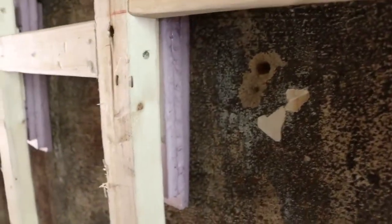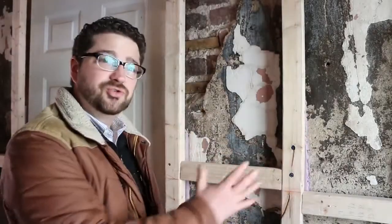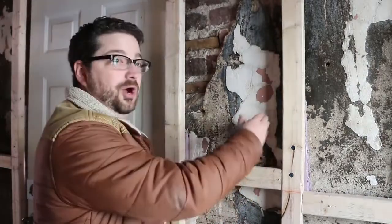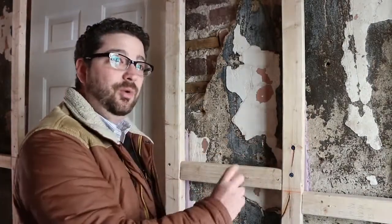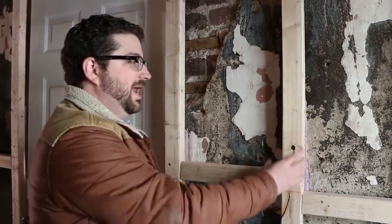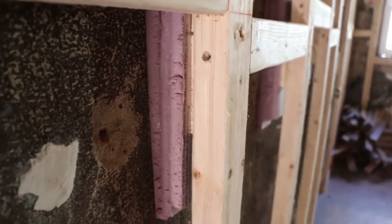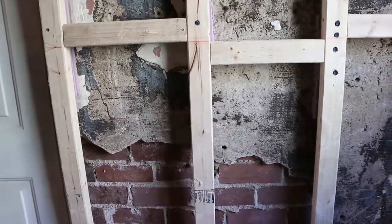One of the more unusual pieces of this assembly is we've chosen to use foam blocks behind the studs here in the middle. We needed to anchor the studs in the middle for extra support since we're going to be hanging drywall on it, and we used foam behind them. The foam is going to provide a thermal break so that no heat can come through or go out through what would normally be a weak point in the assembly. The foam will also prevent any water or moisture from wicking through the wall into the wood, so it acts as a capillary break — it prevents capillary action.